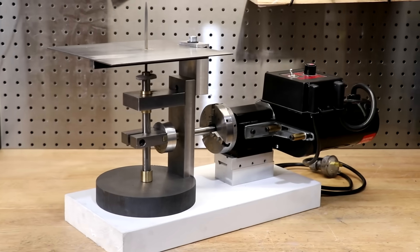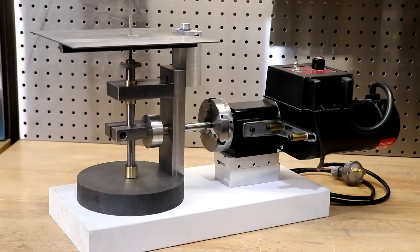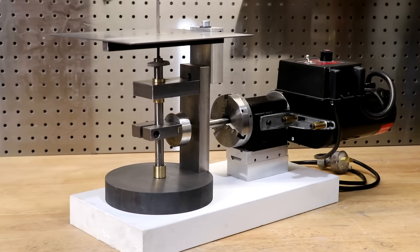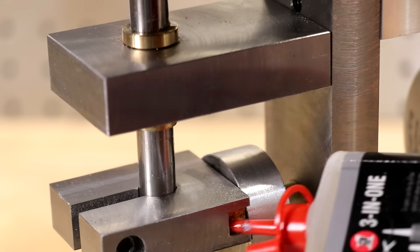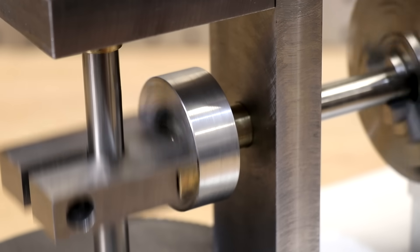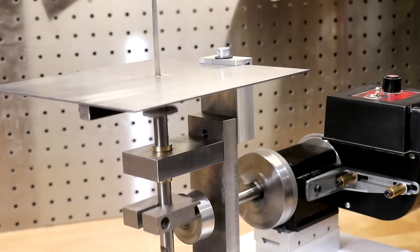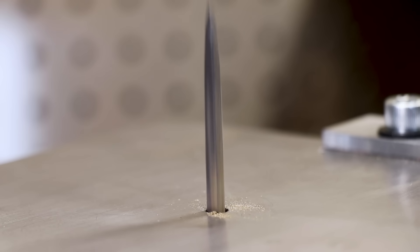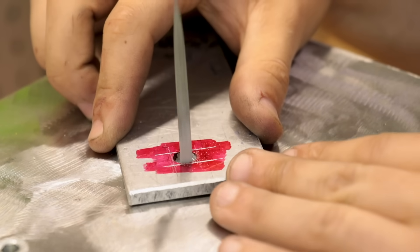If you're doing any amount of filing, these machines can be really great tools to have on hand. But unfortunately, these tools are uncommon to come by nowadays. As I understand it, these were originally made for filing reliefs in metal dies, hence the name. That isn't something that is done nowadays — it's been superseded by newer methods such as EDM — so these machines aren't commercially available anymore. It's for that reason why I made this one in the workshop about a year ago. Unfortunately, I haven't gotten the amount of use out of it that I would have liked to, mostly because buying the correct down-cutting files for these is not easy, and the ones I can find are usually expensive. I don't think anyone makes new die filer files anymore, hence why they tend to be quite expensive. However, I still get good results with needle files.